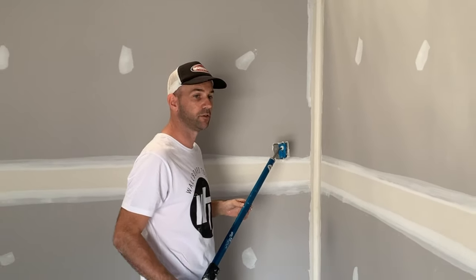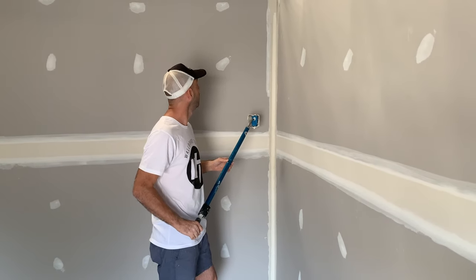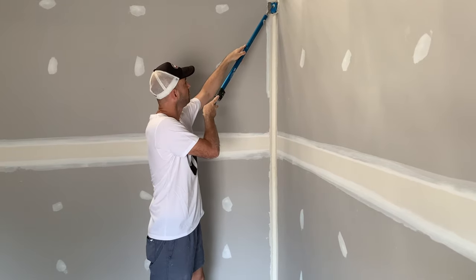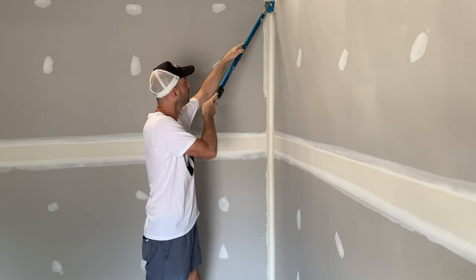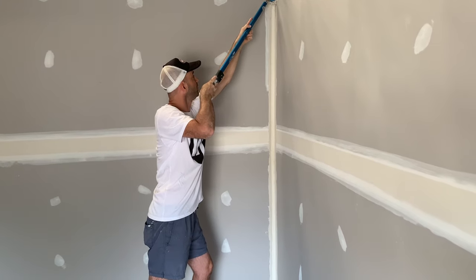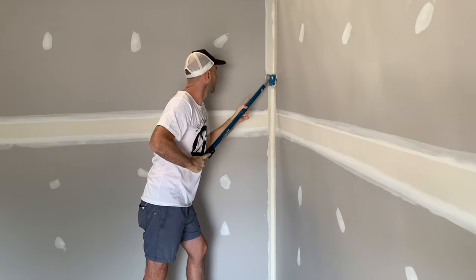What we're going to do now is just use the corner finishing handle and the 55mm metal glazing head. We just start at the top. It's important to make sure that you keep yourself at 45 degrees to the corner. It's important just to put enough pressure to hit the apex of the corner and we just work our way down.